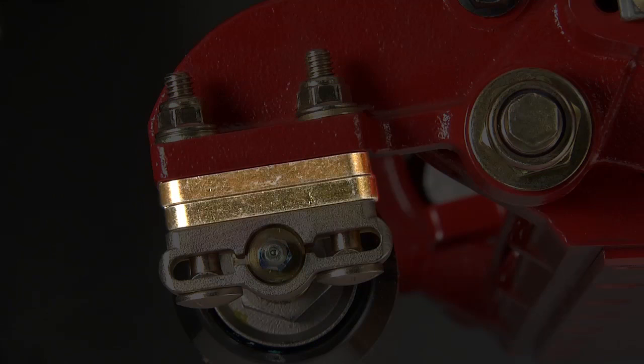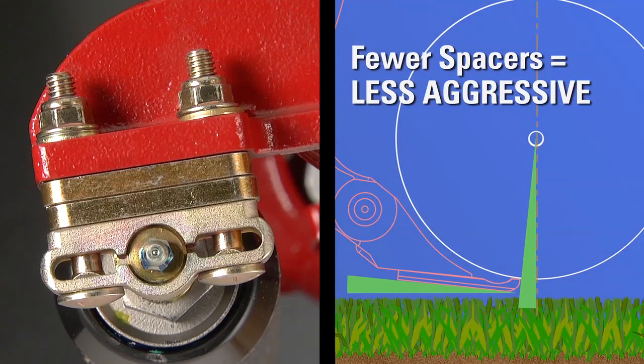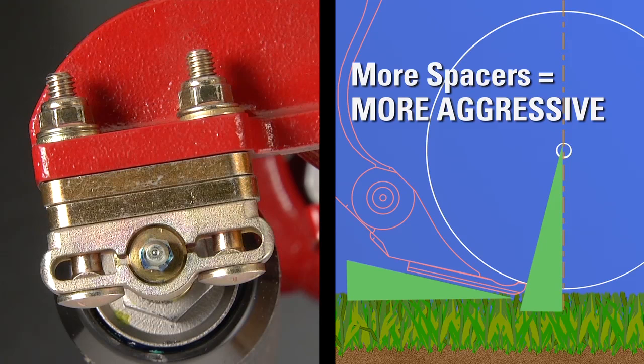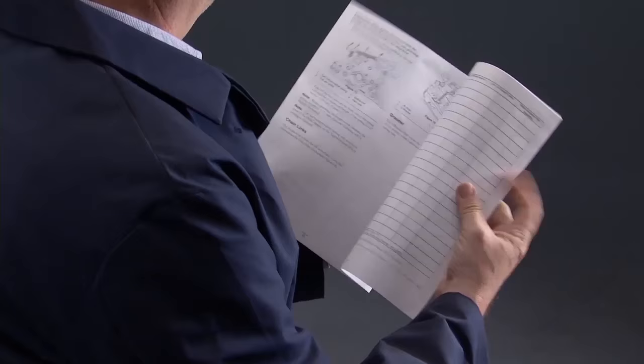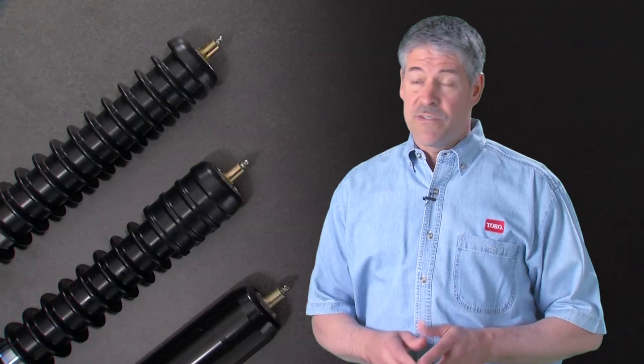On the RM5010 cutting units, the aggressiveness can be changed by the number of spacers on the rear roller bracket. The flattest or least aggressive configuration has few or no spacers, while a more aggressive angle of attack includes more spacers. Refer to the ReelMaster owner's manual for recommended spacer aggressiveness settings for various heights of cut. One important element to remember about rollers is that we are cutting turf with five cutting units, dealing with four overlap areas between the front and rear cutting units. Your choice of rollers can not only determine what you see within the cutting unit pass, but also within the overlap areas.